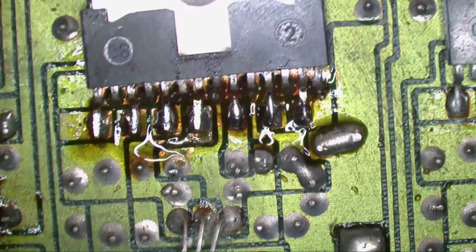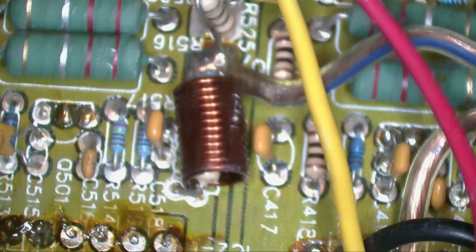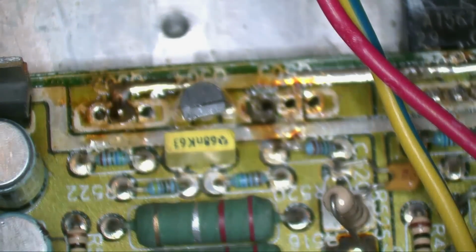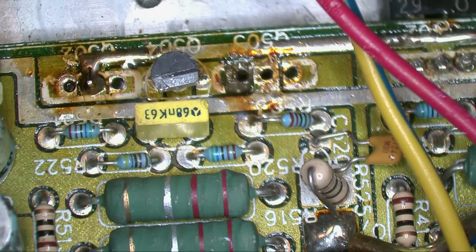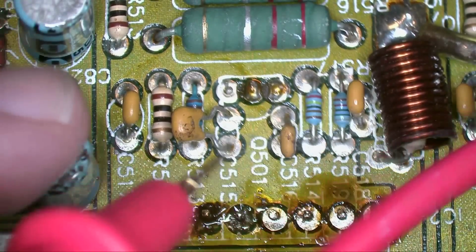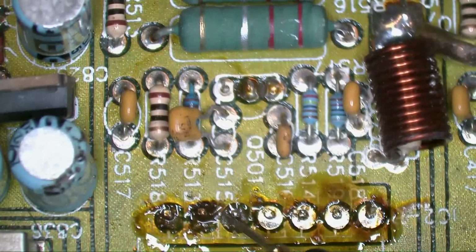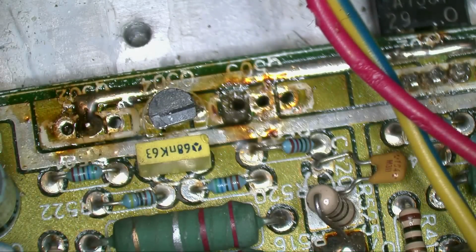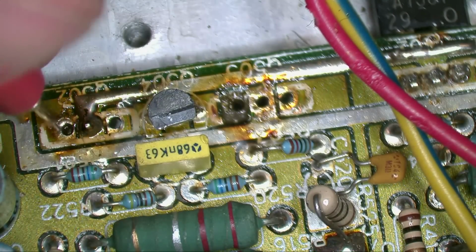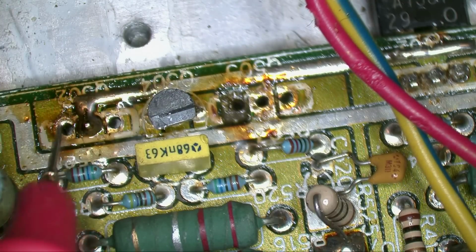I think we'll have to go through the front here a little bit and make sure that we have our connection to this point on that second pin like we were missing before. So we'll go to the second pin and go to that outer pin here, and hopefully we have connection. And we do not. So something else is wrong there.